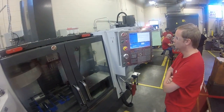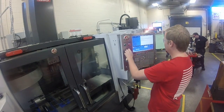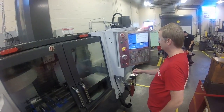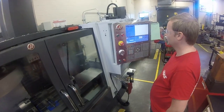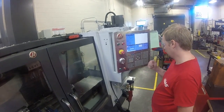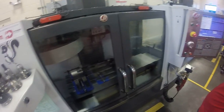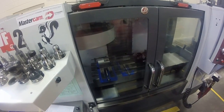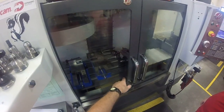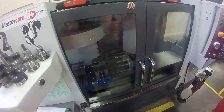Now finish the power up. Pop that off, hit the reset button, and clear that code. Now we need to home the machine with the power-up restart button — the blue button right next to reset. You'll notice the Z axis moves up first, then X and Y, and the A axis will also home.